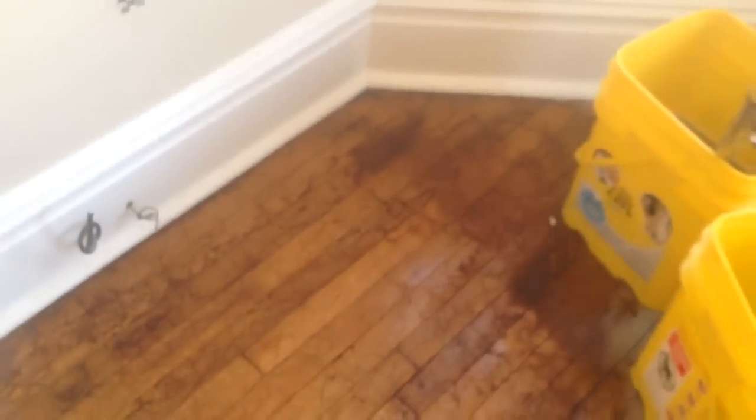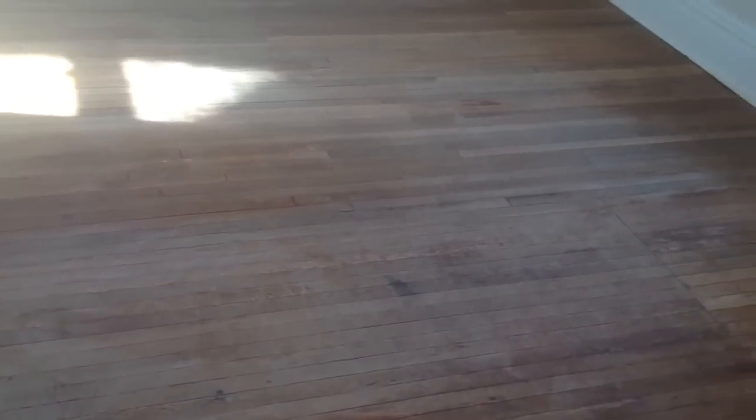You can still see some of the shellac in the grooves, but that'll blend in with the new shellac, or you can hit it with a little alcohol to smooth it out. Here's a floor that's already been done and it's dry — you can see how dry it looks. In the next video, I'll show you what it looks like with shellac on it.